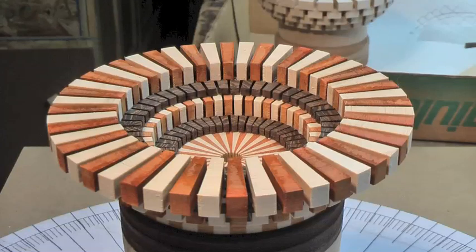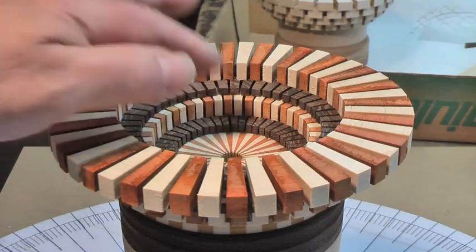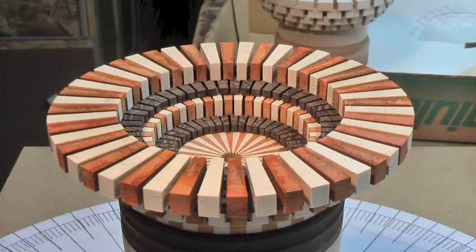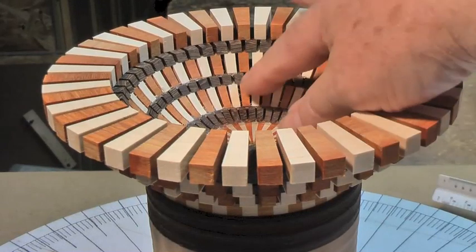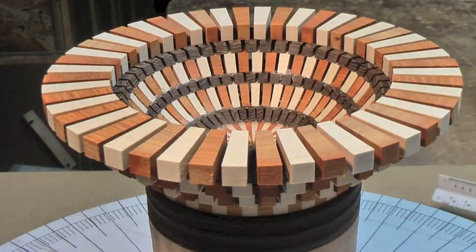That's the fifth ring in place. Now after that glue dries, I'll start to try and turn this center. If it's going to break, let's find out early. Rings 6 and 7 have been put on, and as you can see, I'm getting very little twist. I thought I'd get much more twist out of this, and I would have if I'd have went with 12 pieces. But we'll continue on and see what happens to it.